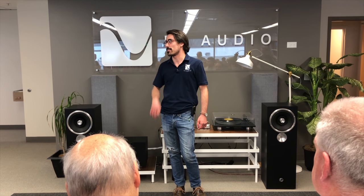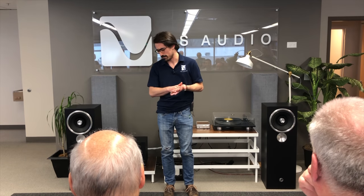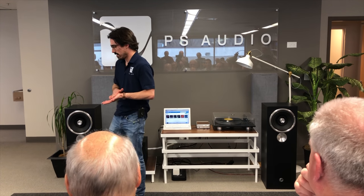So when you go discrete, you're also talking about a production nightmare. I mean, down to matching FETs, down to fallouts because the THD or some spec might not be perfect, because we have to go back and change a transistor for it to go out. These integrated circuits are all laser trimmed, so everything's perfect. And so you have to make sure that your discrete circuits are essentially within tolerance for it to work correctly. So there's a lot of problems with that.